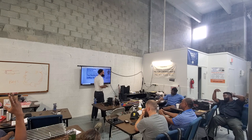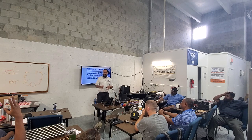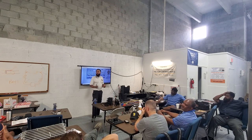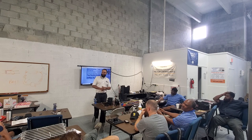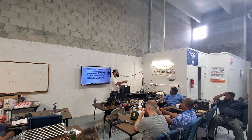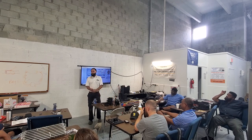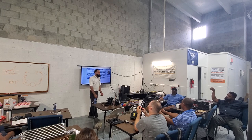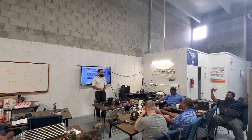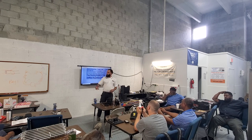Negative 10, negative 20 of a vacuum. Anybody want to go against that, or add on to that? Yeah, I'm going to add on to it, or dispute it in a polite way. We want to pull it down to 30 inches Hg, which is the same as negative 14.7 PSI. Mr. Z said earlier that you can't really get to 30, that 10 to 20 is about it. Well, you want to get to 30. Just go with the book.